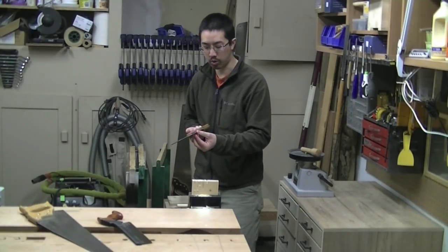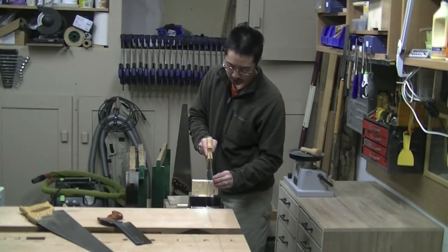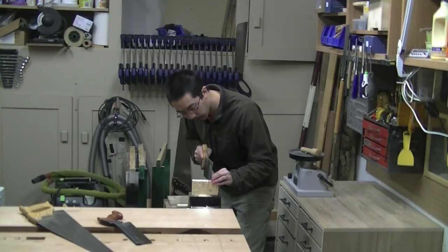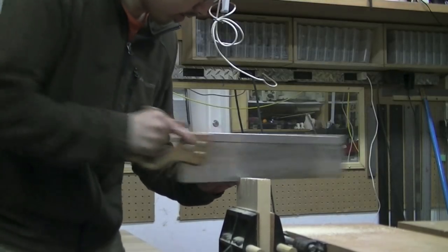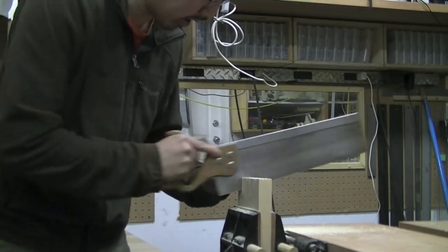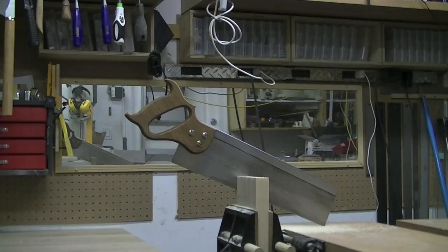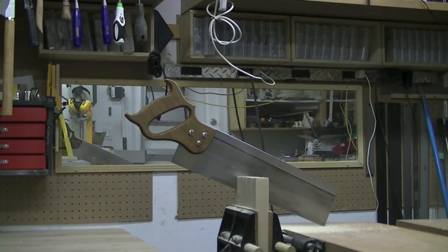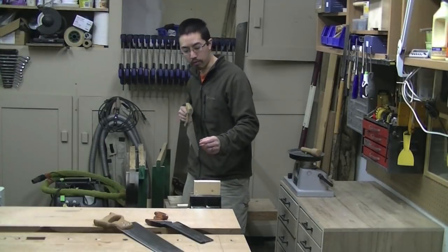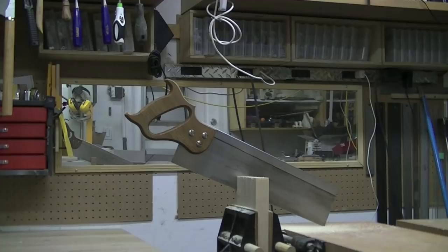Applying this to the custom saw: with teeth running in both directions, I rock the handle down on every push stroke and rock the handle up on every pull stroke. That leaves a very clean cut and is very efficient as well. The result is faster and cleaner cuts with a more intuitive sawing motion — it cuts on the push, it cuts on the pull, cuts all the time. Start faster, finish sooner. It's not a western saw, it's not a Japanese saw — it's the intuitive saw.